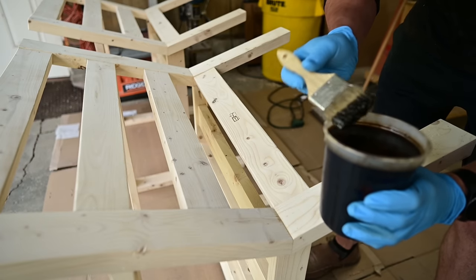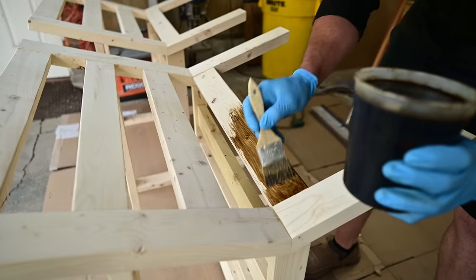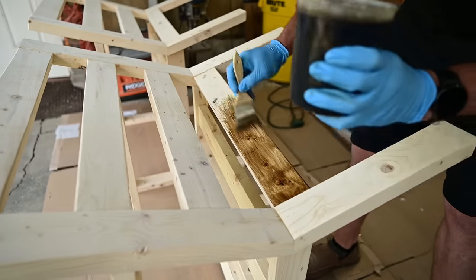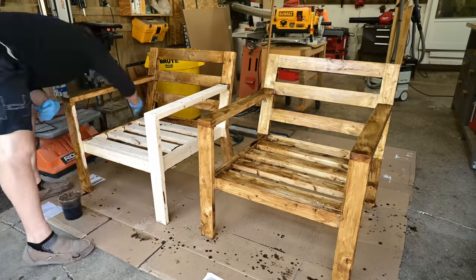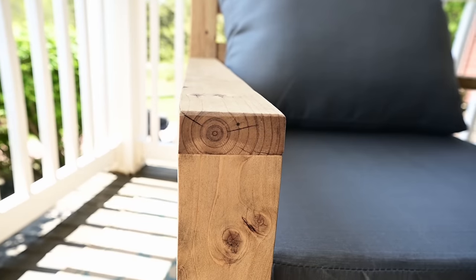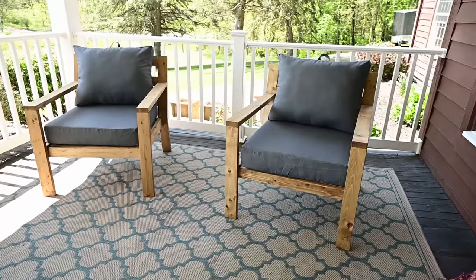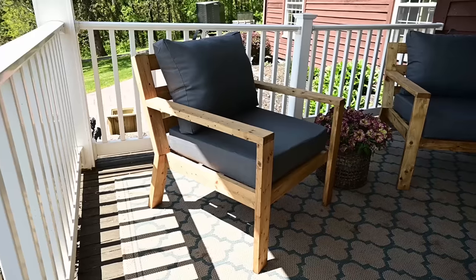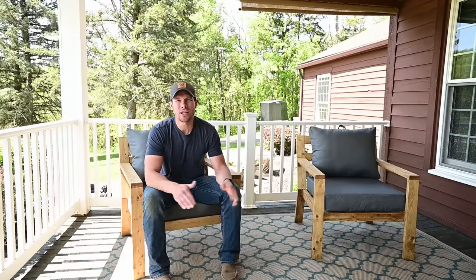I'm finishing these with a mixture of Thompson's Water Seal and Minwax stain — Provincial is the stain I used. Brush it on pretty heavy, let it sit for a minute, then wipe it off with a towel. Be sure to do a thorough final sanding because upon putting on finish there were a couple spots where I didn't clean up the glue and it didn't take the stain well. There you have it — follow along and build one for yourself. Be sure to email me pictures; I'd love to see them. If you decide to support the channel and purchase the plans, thank you. Hope you guys enjoyed it — I've got another one queued up and I'll catch you in the next video.